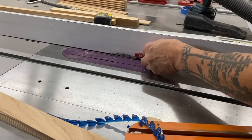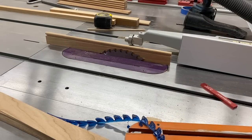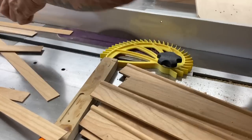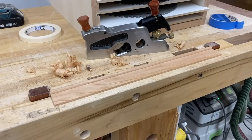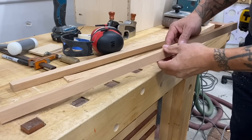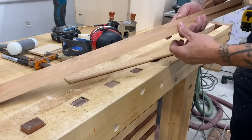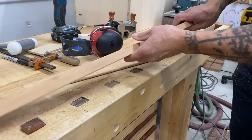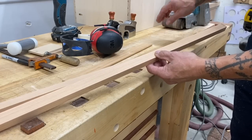For this particular sized handle, I'll use a three-sixteenth spacer to set the distance between the blade and the fence. Here's what I love about this type of fence — I can just move it back without changing my fence setting. Hedgehog featherboard to keep everything nice and tight, and these are the results. These have been ripped off a wider board, so the top and bottom edges were run through the jointer and planer — those edges are good. The cut edge had some scratches from the drum sander, so I'm cleaning it up with a belt sander with 180 grit to get it nice and clean. Then the handle will go on just about flush with the back of the drawer front.